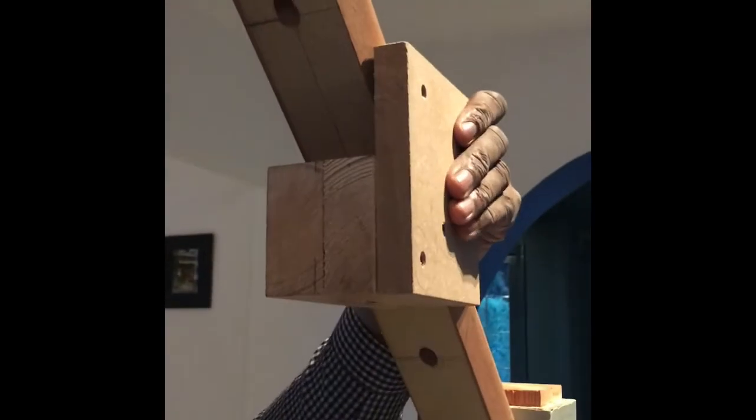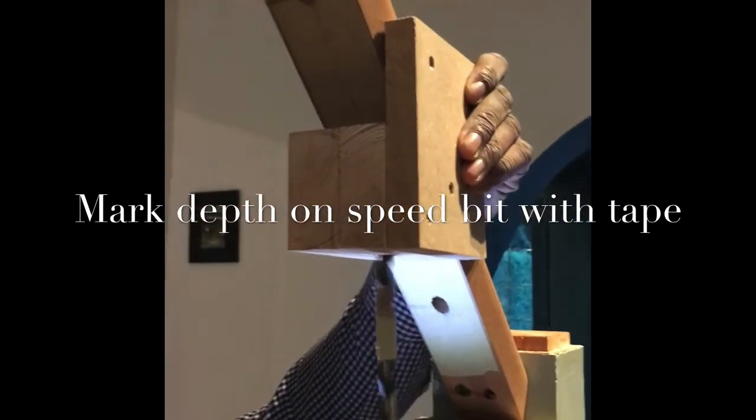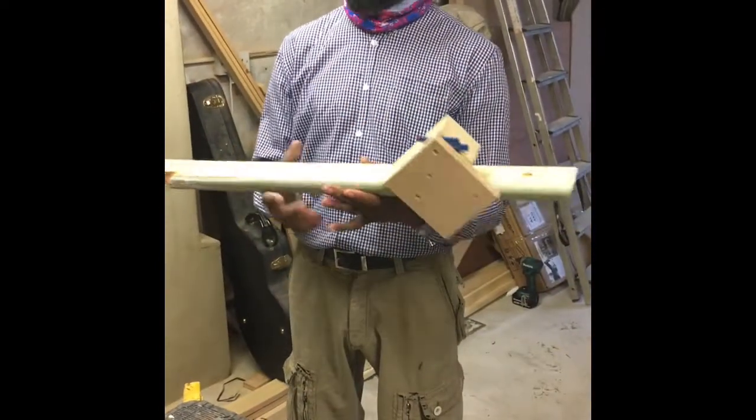I have my auger bit in my pre-drilled hole. Now this section here would normally be clamped. But as this is for your purpose only, don't need to do it, it's already been done. Just showing you. This will be clamped to the handrail. Place it in, drill away, as many times as I need to. So it's all about the template. You get that right, your little jig, you're rolling.